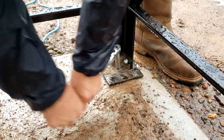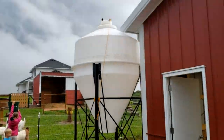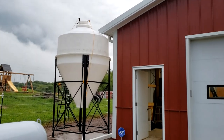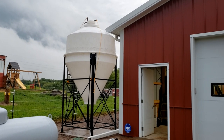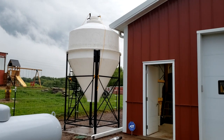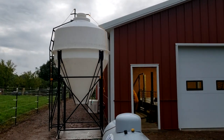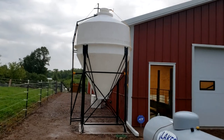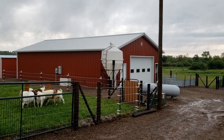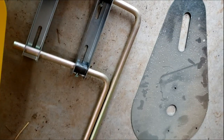One of the shortcomings I have is that to get the auger position right, I had to get this thing close to the barn. I'm really not sure I like that — I know it's going to drop a little bit of snow on the top of the bin's edge. With where the auger has to come into the barn, I really only had my choice of 18-foot, 11-foot, or 6-foot auger. Six-foot's too short. Eighteen is too long because I can't get that close to the gas tank. So I had to go with the 11-foot and push it close to the barn.